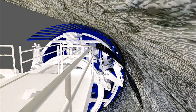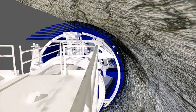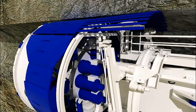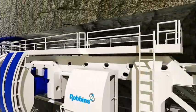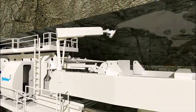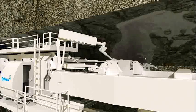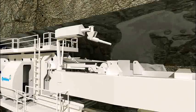A wire mesh erector provides for quick placement of large panels of welded wire fabric. A ring beam erector assembles, correctly positions, and expands a multi-piece ring beam, all within the protection of the shield finger. In some cases, remotely controlled shotcrete robots are the best solution for ground support in fault zones or highly fractured rock. These robots facilitate the controlled and rapid application of shotcrete at a minimum of time and cost.